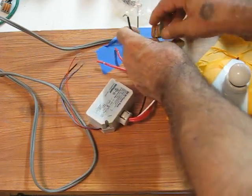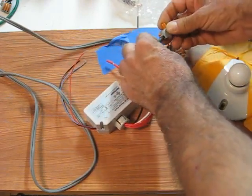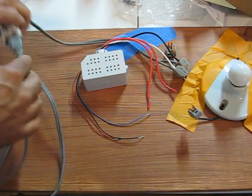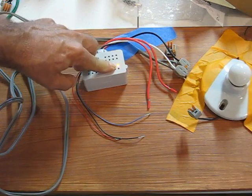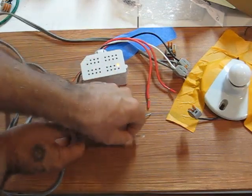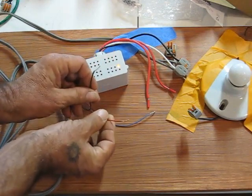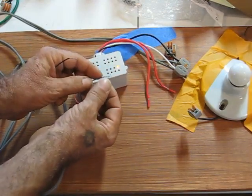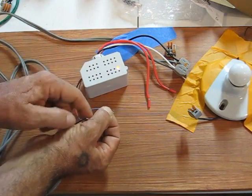And at this point, we should just be able to plug it in and test it. Now, once the unit's powered up, we see a flashing indicator, and now it is steady on, which tells us it's powered up, I presume. We should have 24 volts or thereabouts between the skinny red and skinny black wire. The red one's positive 24. And if I hook the positive 24 to the control line, I should hear the relay click, and this should blink about every 5 seconds, which it's doing.